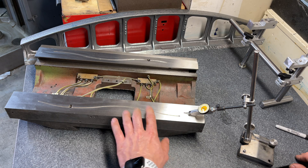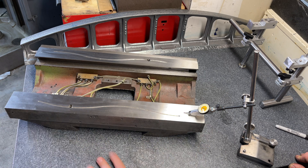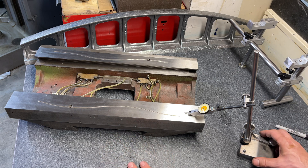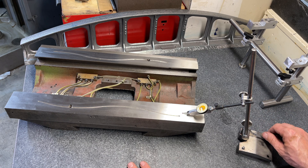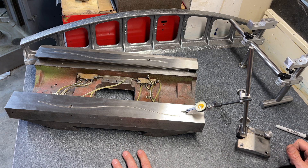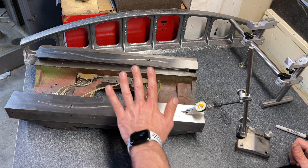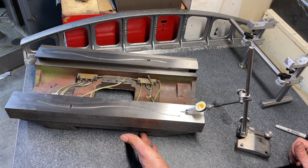The saddle was in bad shape with typical wear on both ends. I sent it out to the local machine shop for surface grinding and they did a fantastic job — it's within a few tenths, maybe even one or two tenths. But they ended up taking around seven thou from top and bottom.